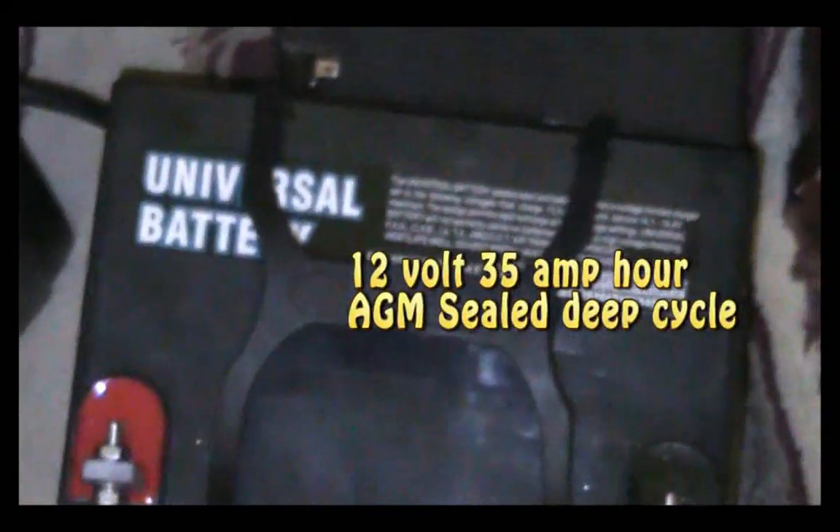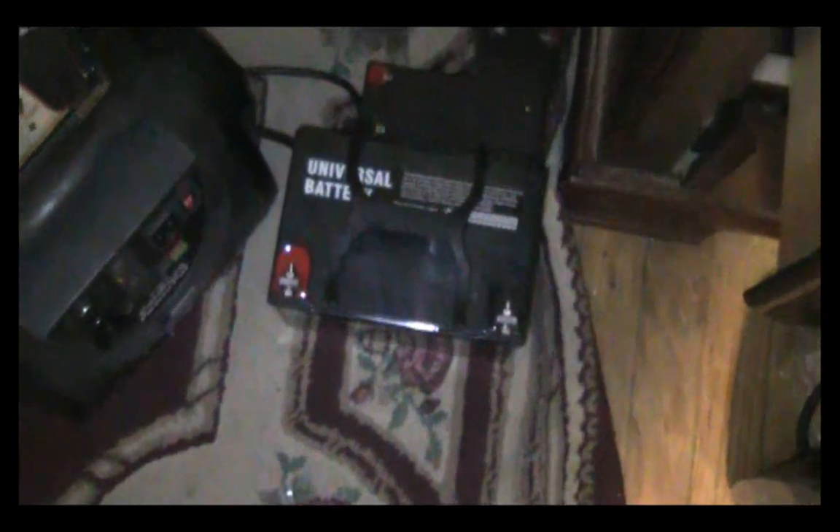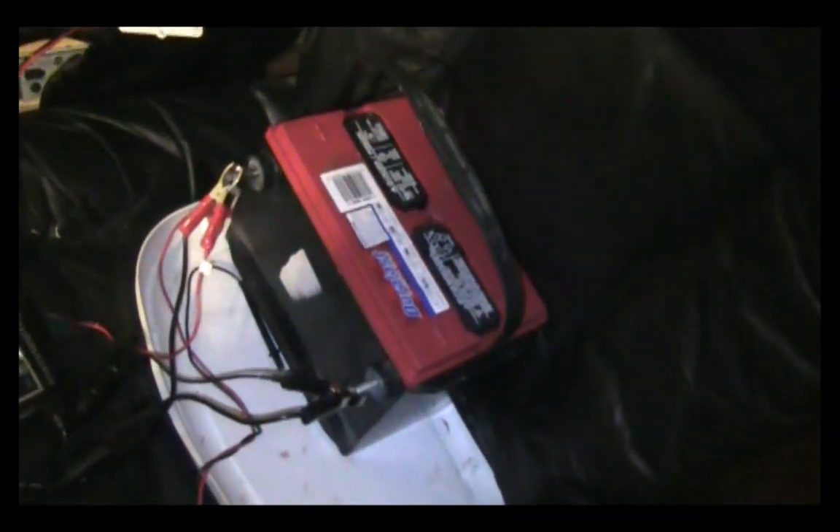If I want more storage, I can hook up my other battery right after this video — this is a deep cycle battery, which is the right type to use. It has thicker lead plates and it's AGM, so there's no hydrogen gas problem that could cause an explosion. I also have almost 30 amp-hours worth of spare batteries around the room. I have a 125 amp-hour deep cycle battery connected to a deep cycle UPS back here, and I'm planning to put a 20 amp-hour battery from eBay in the UPS and keep the big one as a dedicated storage battery for extra energy.